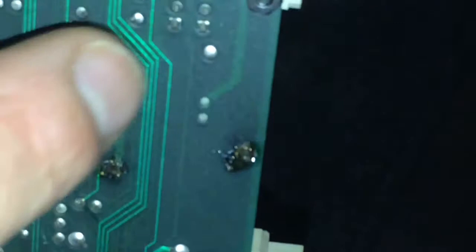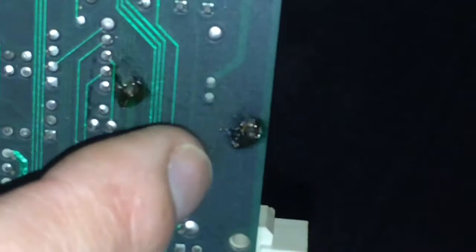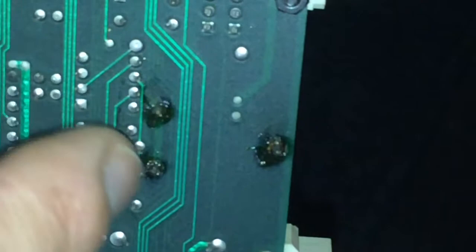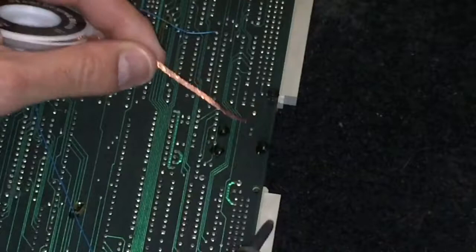There's the battery. Let's go ahead and flip that over — you can see right here these three points. That's what we have to desolder and remove. You've got to be very careful so you don't damage the board. What I'm going to use is just a desoldering braid. I like that better than using the plunger — I just think it's more effective. So let's go ahead and get those off, take our time, and then we'll put the new one in.